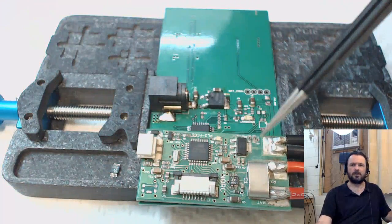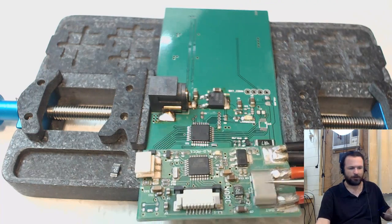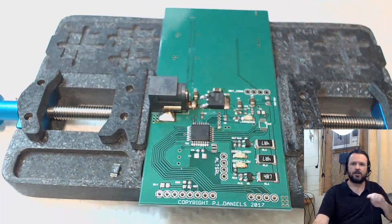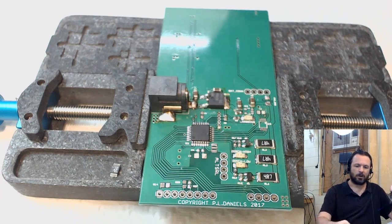These were designed because prior to lithium batteries coming out, most people just used voltage detection on battery packs to determine when they're going flat. But with lithium packs, because the discharge curve is very flat, you can't really depend on that. Under load, obviously, the voltage sags relative to the internal resistance of the battery pack and the resistance of your cables and connectors. So you can't depend on it to know when you need to shut off or at least make an alarm or warning.